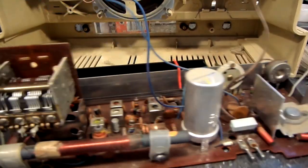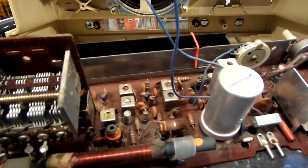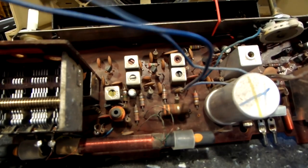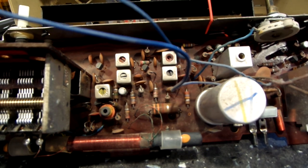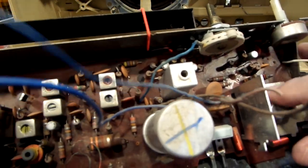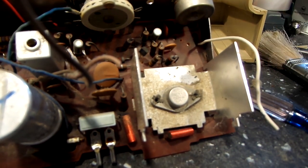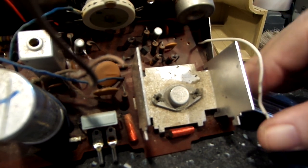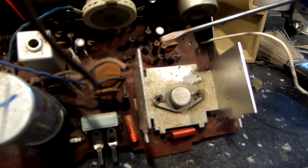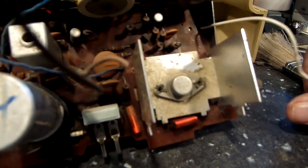Let's get back over here so you can see a little bit better. Everything's visible now. Like I said, I only see four of those coupling caps — we'll just replace them all, they'll all be new, they'll all be good. Works for me. There's some actual grease on that too — that's going to have to be cleaned off a little bit better. I'll use some alcohol for that. We want our heat sink to be free from debris — that way it sinks better, I guess. There are several carbon comp resistors in here. I don't know if they're bad — I can check a few of them. Because what it lacks in electrolytic capacitors it makes up for in resistors.